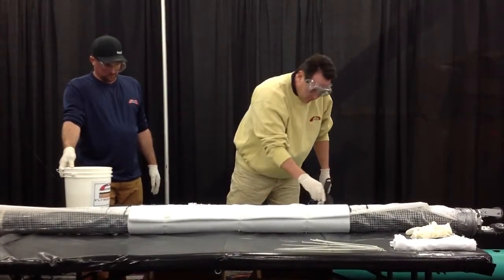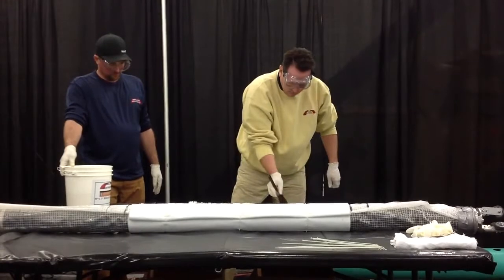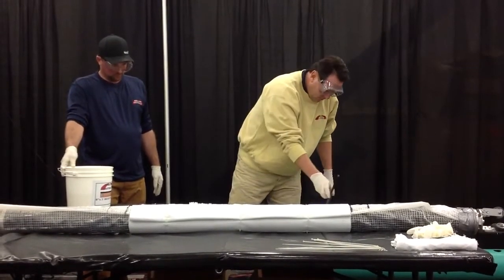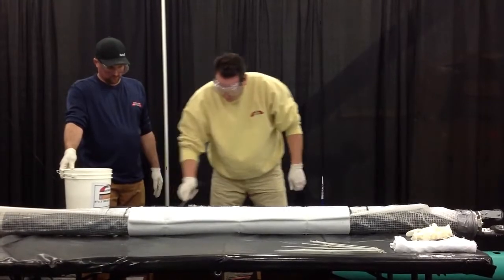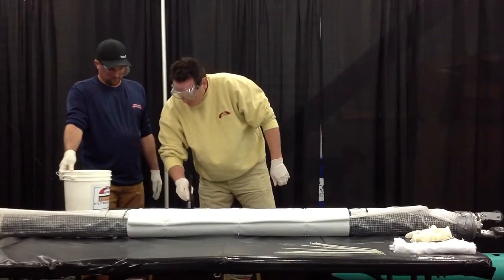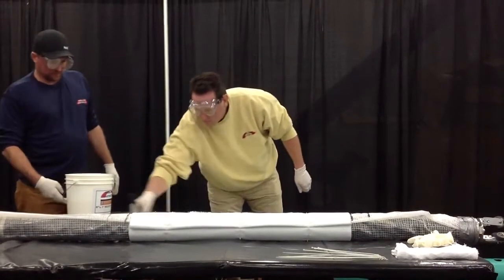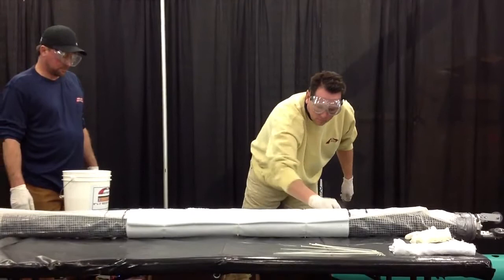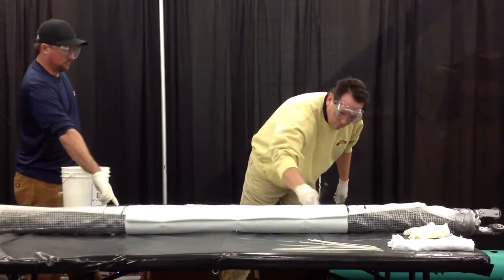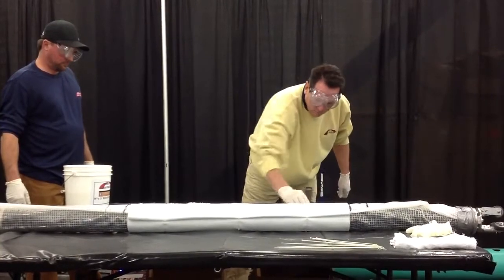The packers are rubber. Today we're using a 100% solids epoxy resin. We can also utilize a sodium silicate-based resin, depending on what cure time we want. Both resins have no VOCs or volatile organic compounds — you can tell there's no alarming odor. They can also be ambient-cured, or we can incorporate steam if we want to get the cure time down a little bit quicker.